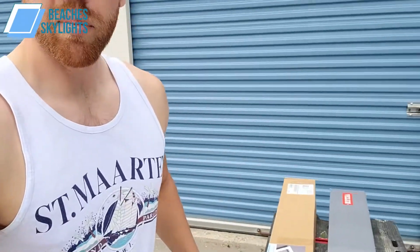All right, so we're just getting into the blind stuff here. As I was filming there, I realized I should cover some numbers and details and info here. Now, when we order any blind or anything, it's all determined by the skylight that we're putting in, right? So a very common size for Velux or any curb mounted skylight brand is 2246, not 24 by 48. A 2x4 in the skylight world is considered 2246 inside dimension. So 22.5 by 46.5 inside rough opening.